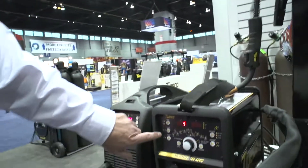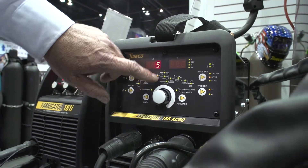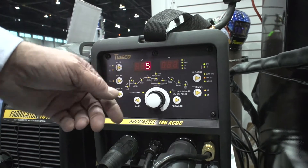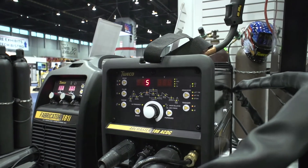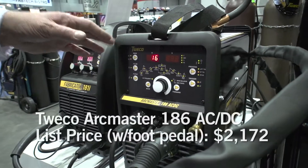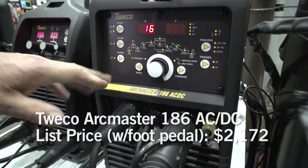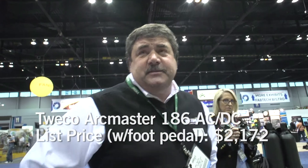This machine in its price range — there are some competitive machines out there that have a lot less features for the same amount of money. What you're getting here is a full-featured machine: AC/DC, fully equipped with pulse and gas purge. You can walk through all the different settings for your weld currents. Pulse from zero up to whatever you want for pulses per second, high and low current. One of the nicest things is you can adjust your wave balance for cleaning and penetration — more cleaning, less penetration, and vice versa. It has arc frequency adjustment so you can change the hertz. Raising the hertz constricts the arc down to a nice tight shiny point, which allows you to do thicker material with a smaller machine. So the machine really is full-featured, and for the cost of it, it's in a league of its own.